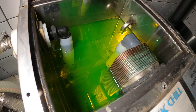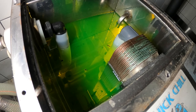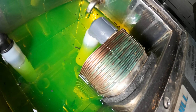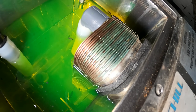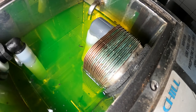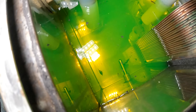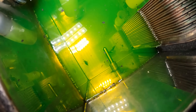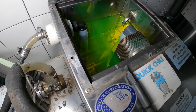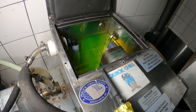Here's a view from the top. I opened this up — see that green stuff? That's water and propylene glycol, which is anti-freeze. That right there is your evaporator, basically just a heat exchanger. The water gets cold from that heat exchanger, and then it gets pumped throughout the system. That little metal rod I'm focusing on is sensing temperature. There's also dirt inside there — this really should be cleaned. Definitely need some maintenance here.